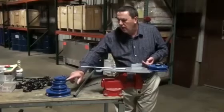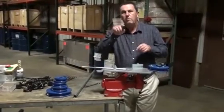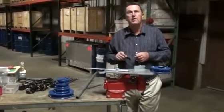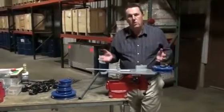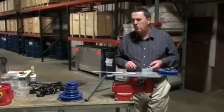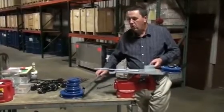They have a unique shape in the edge of the former which basically deforms inwards and very neatly the inside of the bend. Bending square section material is very difficult because the sides want to expand, the inside wants to go all sorts of funny directions, and our design of former allows you to do thin wall square. They come as an option, as I say.